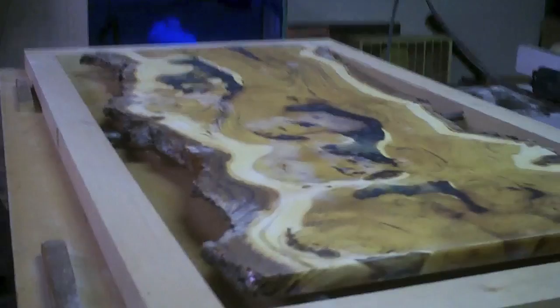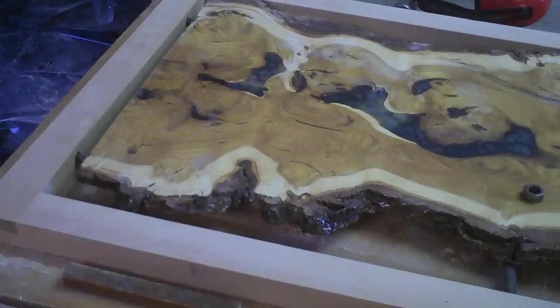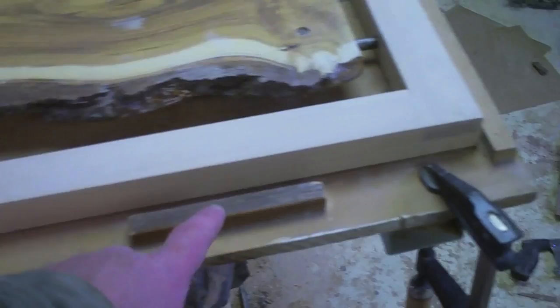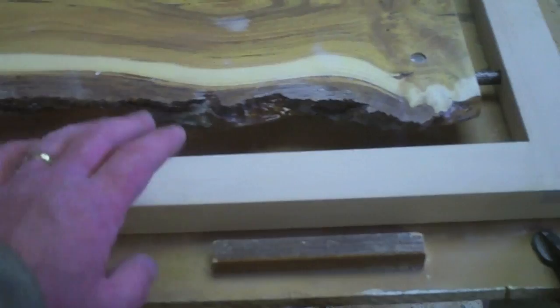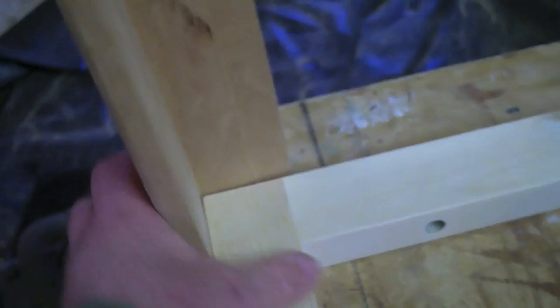You can see the bolts coming through — the top is proud a little bit. Never have too many clamps. There it is in place and torqued up, which did a great job of pulling this down because it had developed a bit of a corner twist. Unfortunately the pieces went in clamped at 90 degrees but came out at about 95 to 100 degrees, so they might be useless. I'm going to go ahead and clamp them on to see if they flex or explode — they're small enough they might flex, but I might be making new ones too.